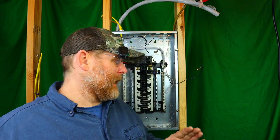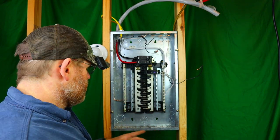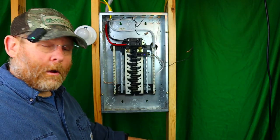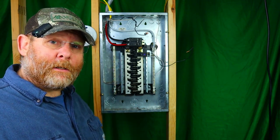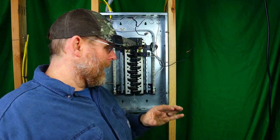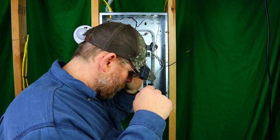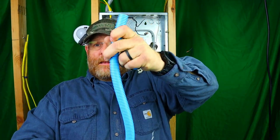Let me tell you about this panel and smurf tube. I wired a house a while back and there were so many romexes coming into the bottom of a panel like this one. The seal plate had so many holes — I like to put a conduit in to go down into the crawl space and another up into the attic so you always have access. What happened was we put too many romexes through the floor with no access. If I'd had smurf tube at the time, I could have knocked a hole out, bent it, drilled through the floor, and had access to the panel at any given time.